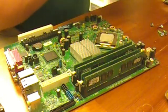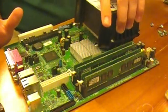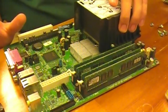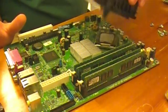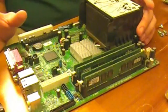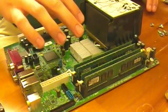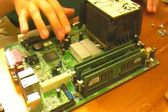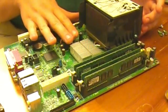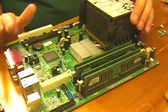It's not a very good design. You've got the heatsink that sits just like this on the motherboard, and you have the hard drive that sits right here. These capacitors here are getting hot air on them because the fan is right here. Plus, if the hard drive is running hot, they've got the heat coming off the hard drive. These things just get cooked.